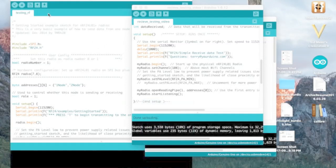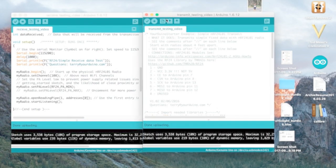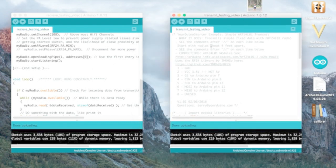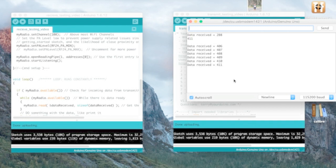Alright guys, I've finally got my NRF transceivers working. This is a little testing code — I'll put these programs in the link below. So what I have is essentially two Arduinos: one's a transmitter and one's a receiver. My transmitter is hooked up to a battery and my receiver is hooked up to my laptop so I can see what the serial monitor outputs. This code starts from 100 and adds 1 every second — and there you go, it works.